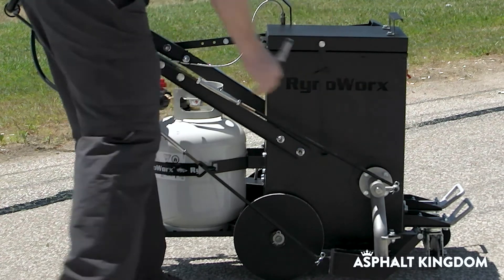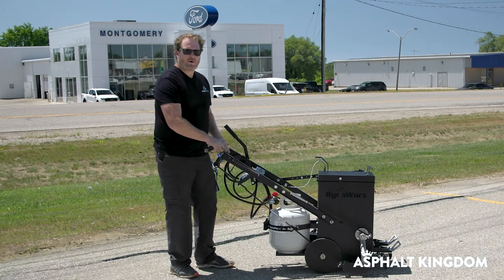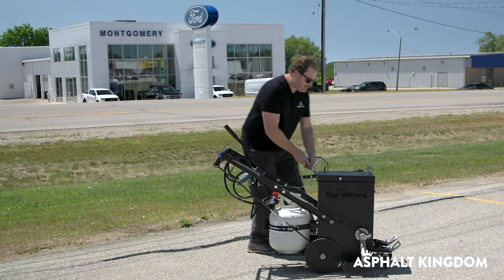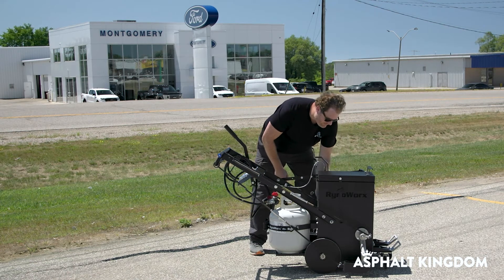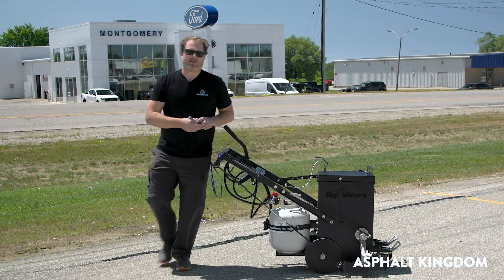Just enough that it'll hold it, not fully tight. Now that I've got my nut set and my height right where I want it, I'm going to go set the other side and torque these down.